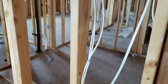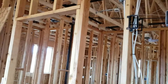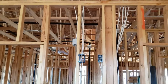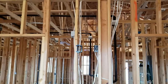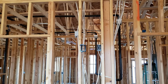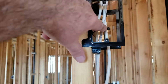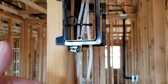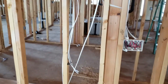Be sure you write down what each color means and which room it corresponds to — that way there are no questions later once the sheetrock goes up. I also highly recommend going through and taking pictures of everything before the sheetrock goes up after you've done the pre-wire. That way, when the sheetrock is up and you're scratching your head wondering what you did, you can refer to your pictures and figure out how many cables you ran or troubleshoot any issues.